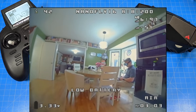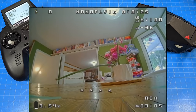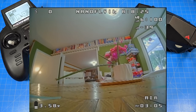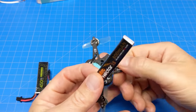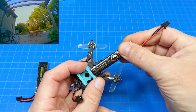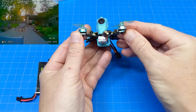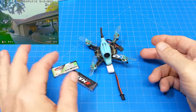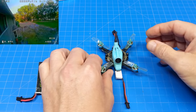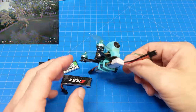I did fly at least one battery inside and this is what we have. At the end of the flight it's 3:05, and battery voltage is in good shape, coming up above 3.5 volts per cell, almost 3.6 volts per cell. You can see how the battery kind of curves the bottom part of the tray — it still sits mostly flat with the pigtail out, but it's not perfectly flat because of that little bow.